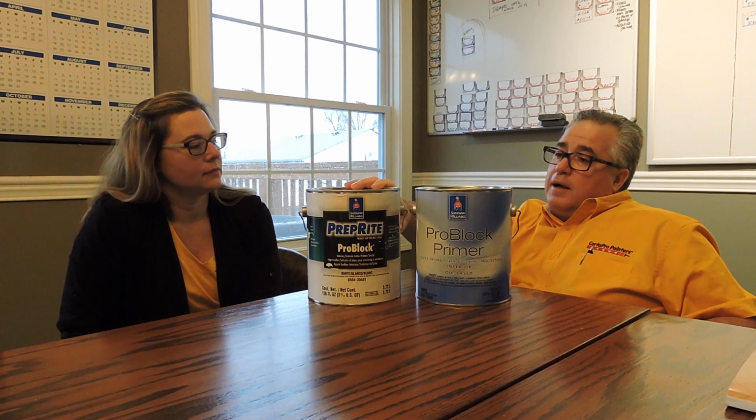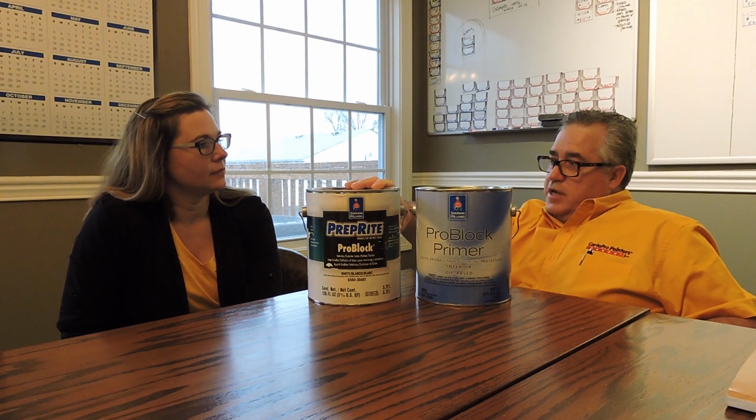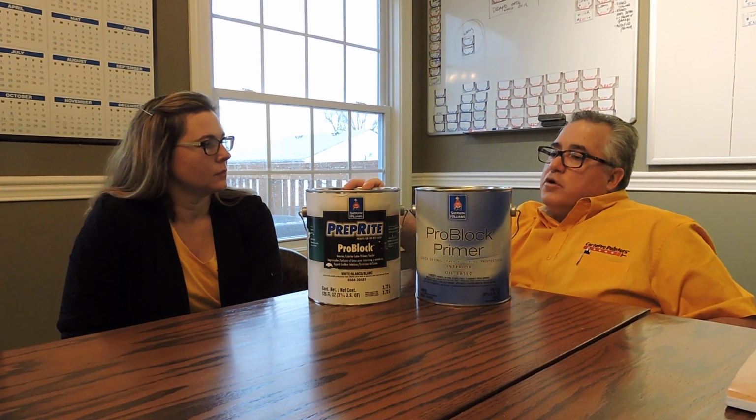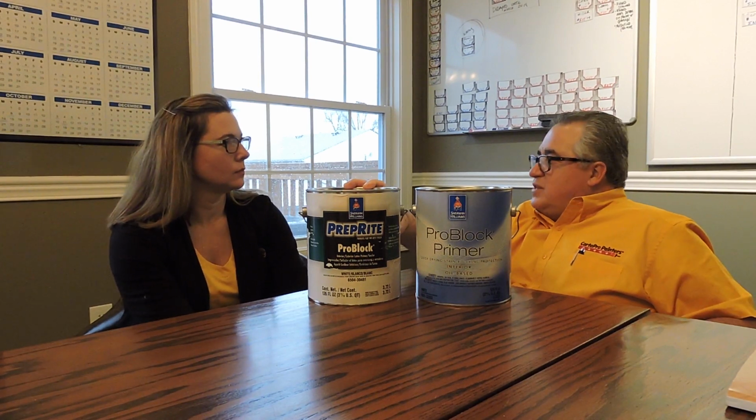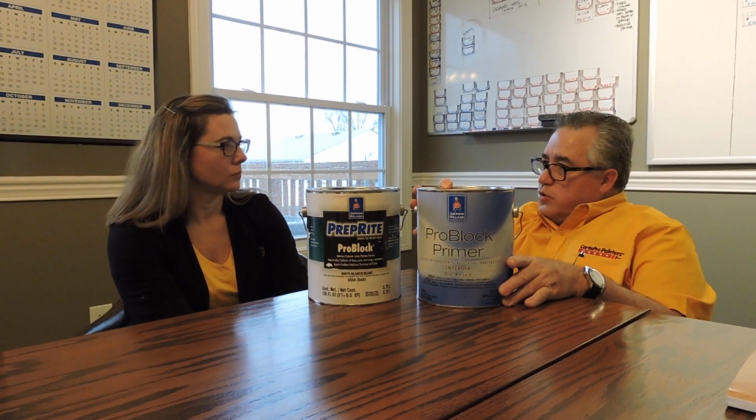Well, sure. An acrylic, the Prep-Right product here, you would use on your lighter stains, and your alkyds you use on your heavier, deeper stains. Now, of course, that's really easy for me to say, but what exactly does that mean, right? So your acrylic primer you'd use on a very light shadows of stains. Whereas on your alkyd product you'd use on deeper stains, like a very heavy, stubborn water stain, you'd want to use an alkyd on.